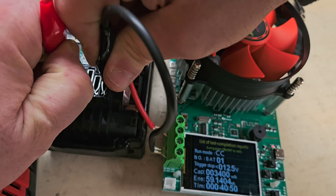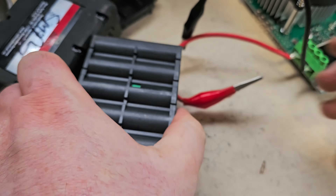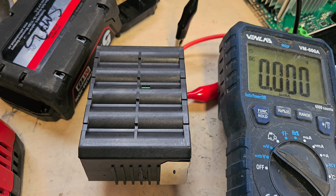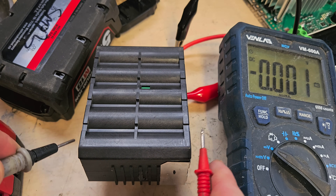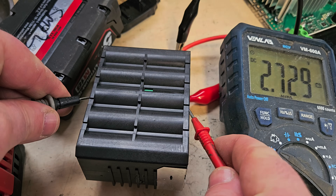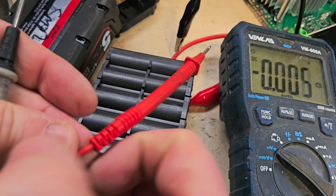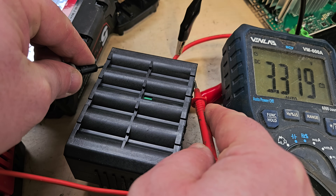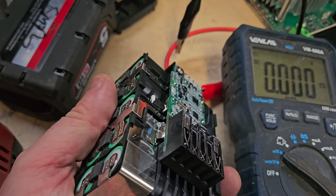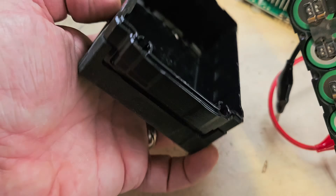What we have to do now is get this back out of the case and test how the cells responded. This is the way you find out if the cells are actually all weak or if there are any bad ones. The readings are: 3.14, 2.7, 2.7, 2.7, 2.7, 2.7, 3.21, 3.21, 3.31. So the cells are all over the place as far as strength is concerned. Once it got down to a certain voltage, some of the cells recovered better than the others. We'll put it together and try it in the charger to see what happens.